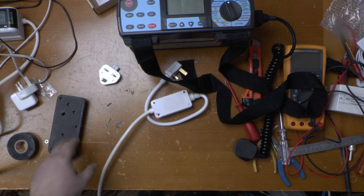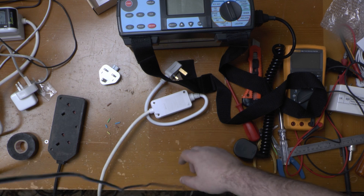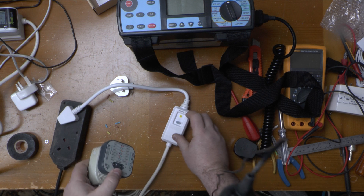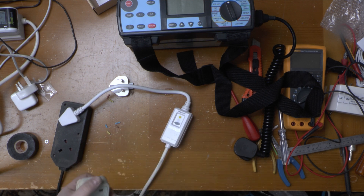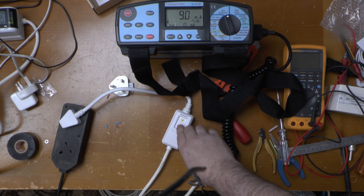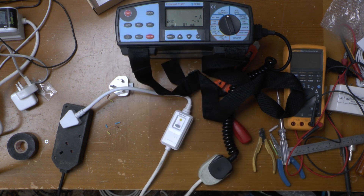The screws are on and I've got a feed here coming from a socket on its own circuit. It's still RCBO protected because all the circuits in the house are RCBO protected, but I'll try it anyway and see if this trips before the RCBO does. It didn't like a Q-check plug — that's interesting. Let's try it. Nine milliamps — at least it does actually trip. Let's do that again. Yep, at least it's consistent and it does actually trip.